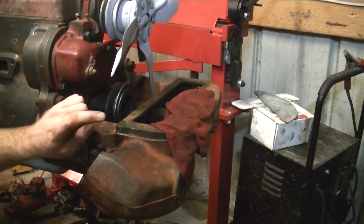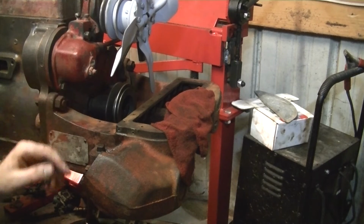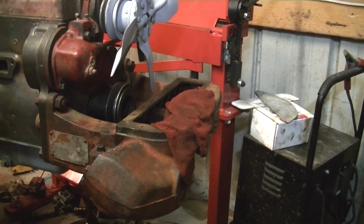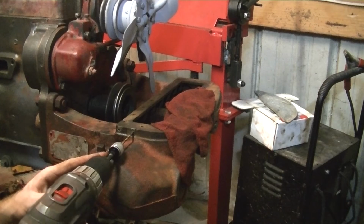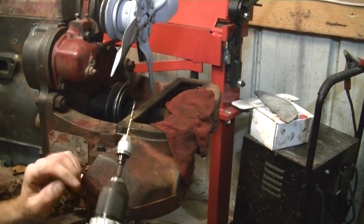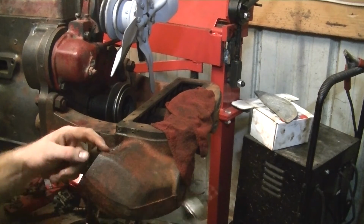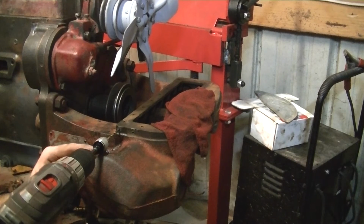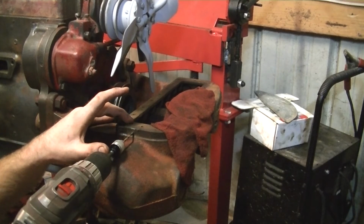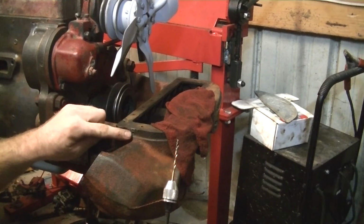And I think that is the worst one to drill and tap on the bolster. The other two on the other side, you can just use a regular drill, come in at them with the drill bit and drill them straight. On this side, I really believe you need some type of extension, because it's hard to find a drill that actually has that small of a chuck on it to get in to these two locations. This one's a little more forgiving, but this one, that ear there is right in the way. Even with this small chuck, it still rubs it when I'm holding it down to keep the bit going in straight. So you really have to get something like this if you're going to drill this one out and this one as well.